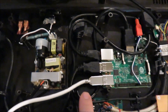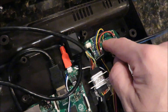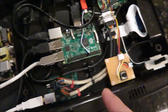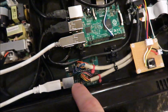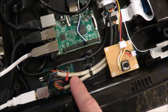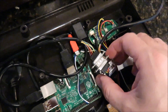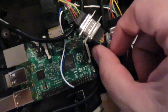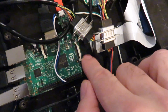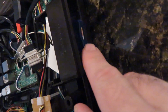The other two USB ports: the bottom one is going over to an Xbox adapter, which I've taken out of its case. I soldered onto the little switch and the little LED and brought them out to the front panel. The other USB port comes over here to the Ultimate PC Interface for Intellivision, which allows you to hook up real Intellivision controllers to a PC. I replaced the cables that came with it with 9-pin DB9 connectors, which then go out to your two Intellivision adapters. There's a little extender plugged into the microSD card slot, and the ribbon cable goes here — that's how I get the SD card accessible from the outside through the cartridge slot.